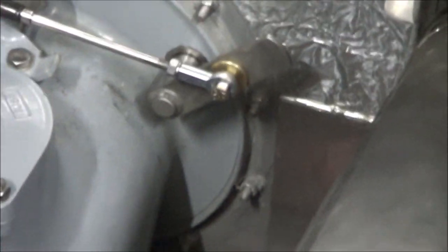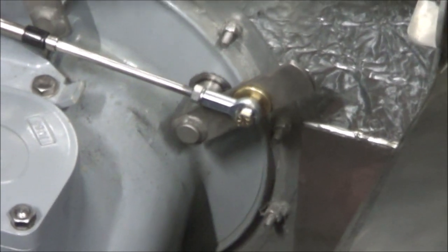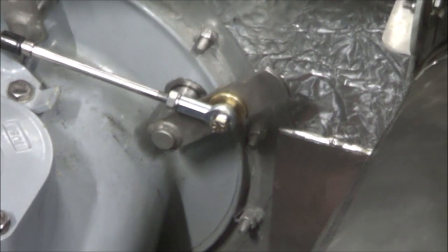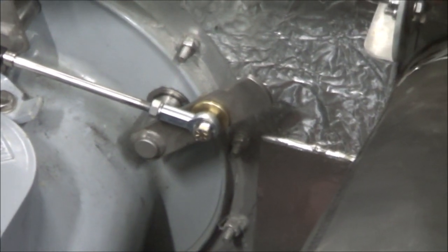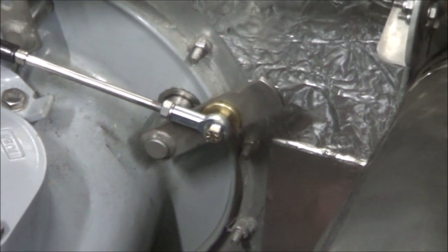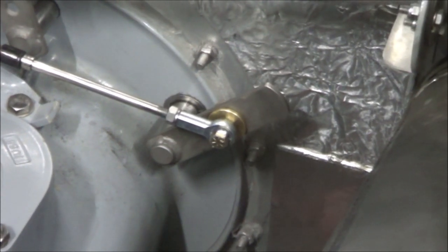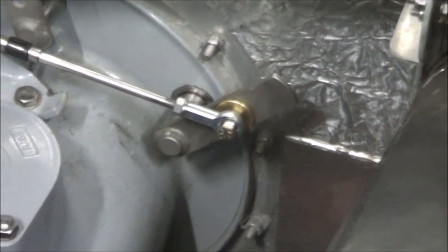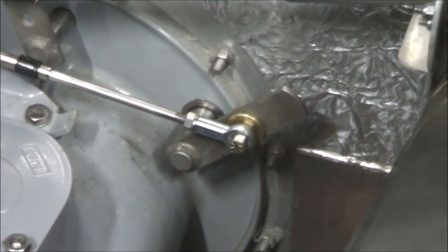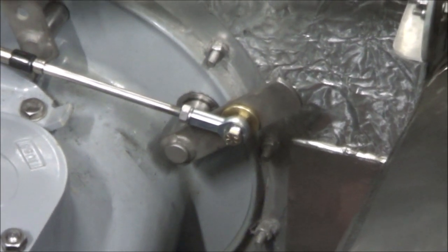Here's the simplified setup. And it's all installed and functioning. In the shop here, it's not as much of an improvement as I had hoped for. It definitely is some, but the system still is a little bit stiff going into forward. Hopefully it won't be bad getting into reverse. That's the main thing that I was having trouble with. It would just jam sometimes going into reverse. But getting into forward, if I hang the chain from the bucket, it's still pretty darn hard.